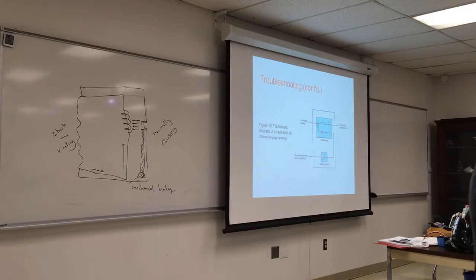So we have a relay. Do you know what the components of a relay are? We've got the coil and linkage. If you were to test any relay, what would you test? The coil. The coil, you should get some reading. And you can check for the linkage, make sure it's not loose. If you were to go and test the pins, it should give you a reading. Let's look at that. Also, on the last slide, the coil and the contact, that was for the relay. Yeah.